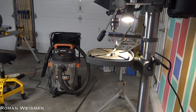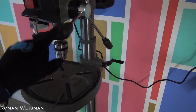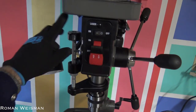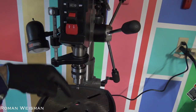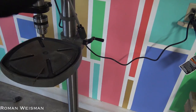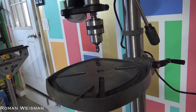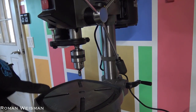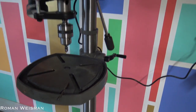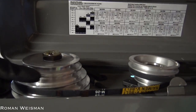For those of you that don't know, this is a drill press. This is how it goes up and down — there is a stopper on the bottom and on the top where I can configure how deep it will go, and this configures how far up it will go. This way I don't have to rotate it all the way up and down — it just stays in position. This is the place where I change the bits, and here I can change the speed.